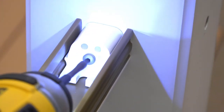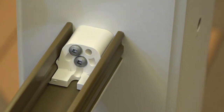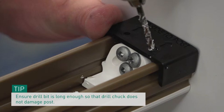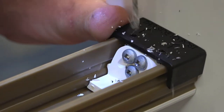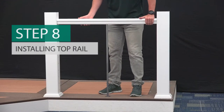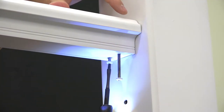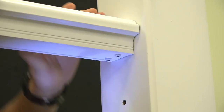Drive two pan-head screws down through the top beam to connect the mid-baluster support to the top beam. After ensuring that your top beam rests squarely in your mid-baluster support, secure the upper bracket and beam to the post using six of the provided mounting screws, using three per bracket. Be sure to begin with the bottom center screw to avoid misalignment. Set the Transform Cable Rail drill guide on top of the bracket next to the post. Using a 1/8-inch drill bit, drill from the top of the guide through the top bracket and beam. Repeat on the other end of the rail. If your installation is 42 inches high and exceeds 91 inches in length, you'll need an additional rail stiffener purchased separately — simply measure to length, cut, and install as illustrated. Starting at either end, snap your top rail onto the top beam until the full length locks into place. Finally, install two of the supplied painted screws upward from underneath through the pre-drilled location to secure the bracket, beam, and top rail together. Repeat for the other end of the rail.